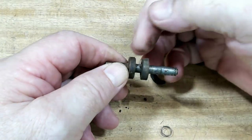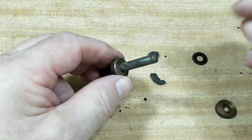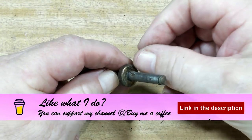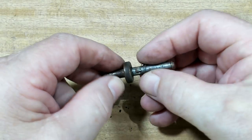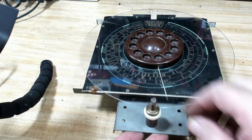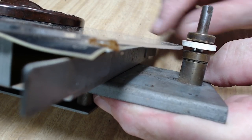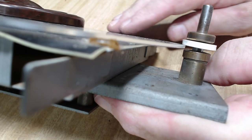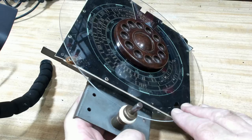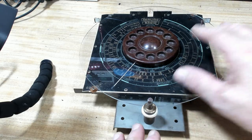Just thinking about it again — it probably doesn't have two bits of rubber. It probably has one piece of rubber, and it grips on the rubber and the brass bit here, and the spring pushes on the rubber. I've made a little rubber washer here but there's a problem. The little plastic disc that the owner had made isn't the right diameter. It's too small and it's also out of round. So I'm going to have to make a new disc.